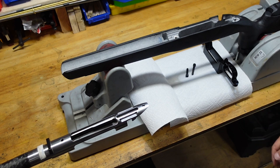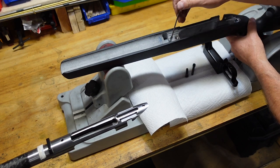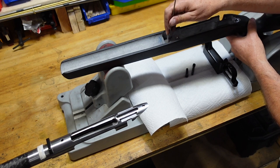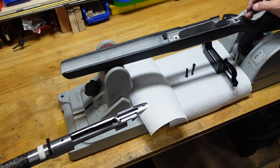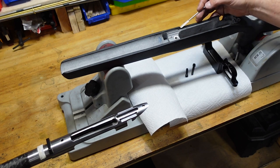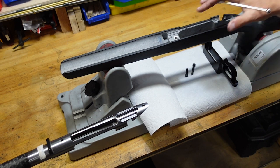Inside the stock you can see I've been in here with a milling machine, cut out grooves, and opened up the recoil lug area. You want to make sure you've got enough epoxy front and back of that recoil lug. I want plenty of epoxy behind it to help hold and bed it correctly. I leave a little bit on the rear tang because that's set to my height for the receiver, and the pillar is set correctly so my receiver depth is flush with the ejector port in the stock.